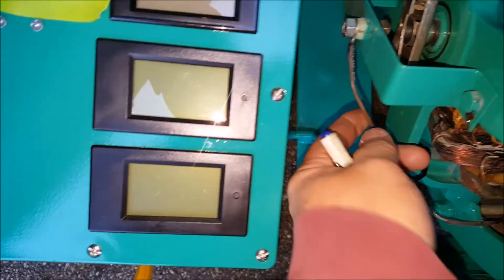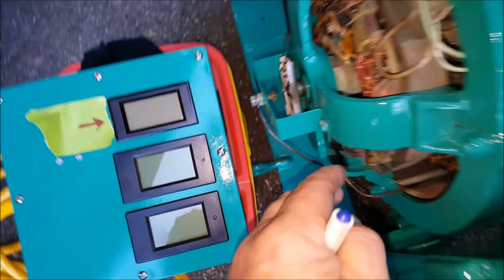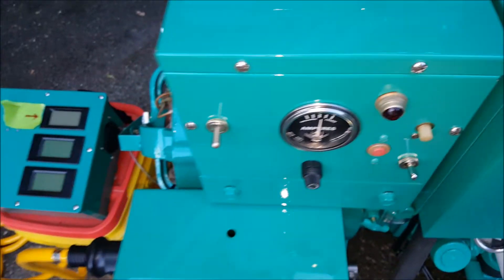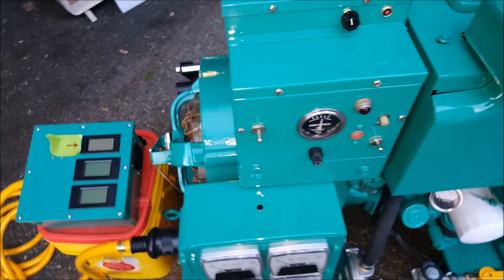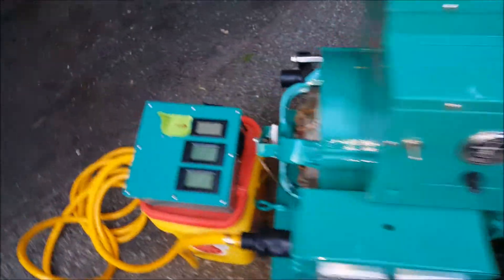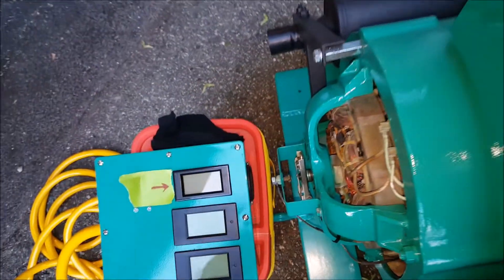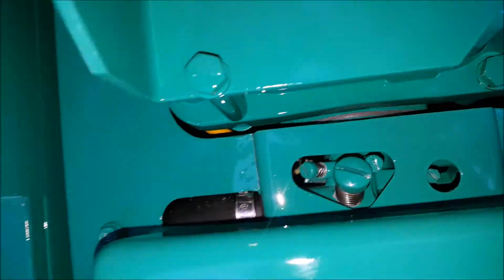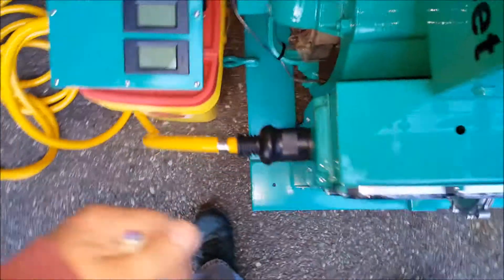We're back. I've hooked up the wire now, so when this arm extends out it's going to ground out the system and shut down the generator. What I expect to happen is that this light will glow red, this button's going to pop out a little bit, and the generator's going to shut down. When the generator is totally off, the light will still be on and the button will still be popped out. The only way to restart the generator is to push this button in. I don't want to have to deal with manually pushing in the little lever, which would mean removing the bell cover while it's in operation. So my plan is to manually increase the speed using the idle set screw until I achieve about 74 to 75 hertz — let's see if we can do this.